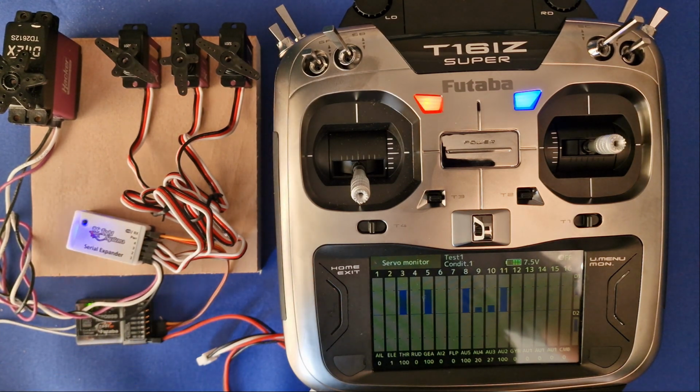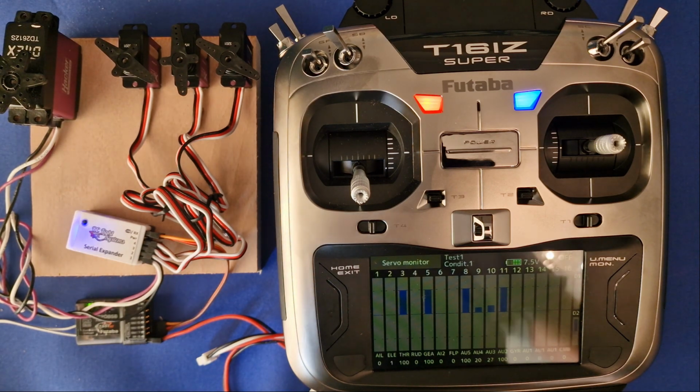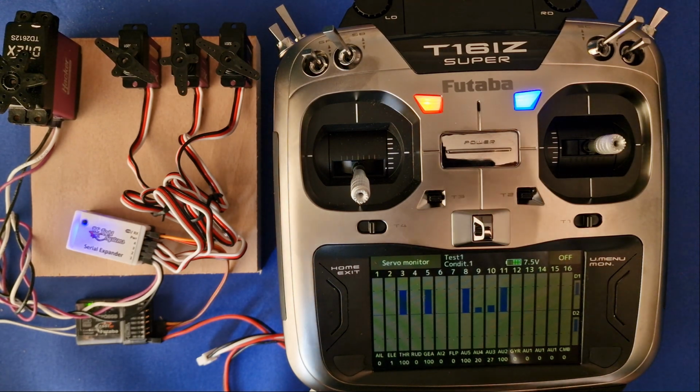Once you've done that, you can power cycle it, hold the button down, you'll get that slow flash. As soon as you see that, release, and then click again, and it'll go into the auto learn mode with the flashing red to tell you which output it's looking at. That's how you set up auto output auto configure on there.